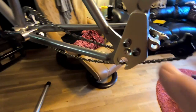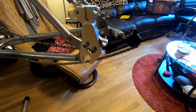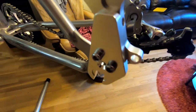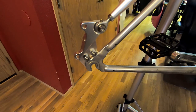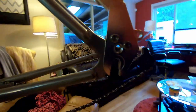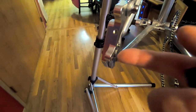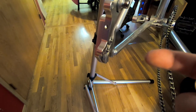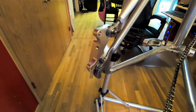You can see the couple of screws I put in here — they're just derailleur clamp screws, so I did have to drill the holes for these. I set it up, put the wheel on with the skewer, tightened it all down, got it adjusted where I wanted it, matched up the dropout angle once it was set into position, then went in with a 90-degree pick and scribed the bracket so I could drill it out on my little mini drill press. It just turned out awesome.